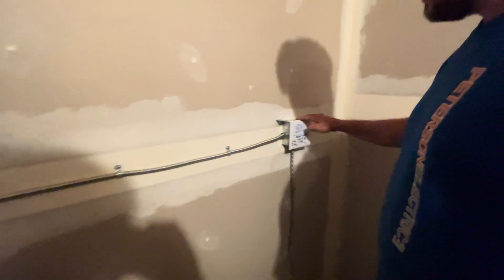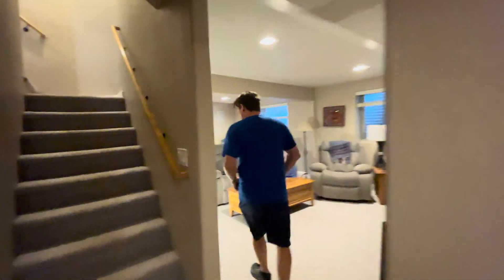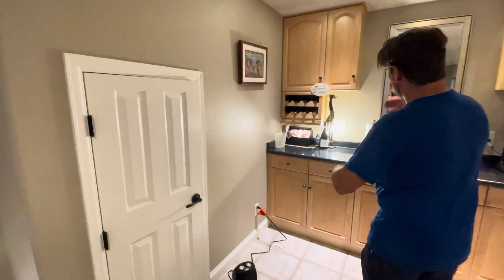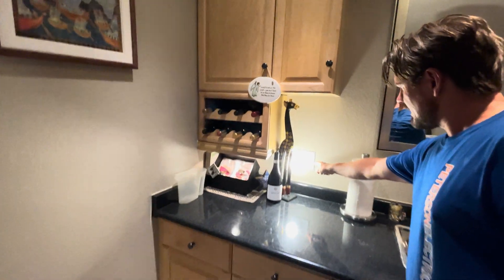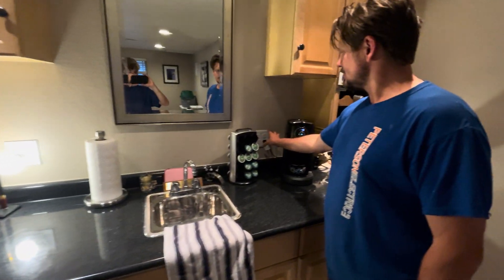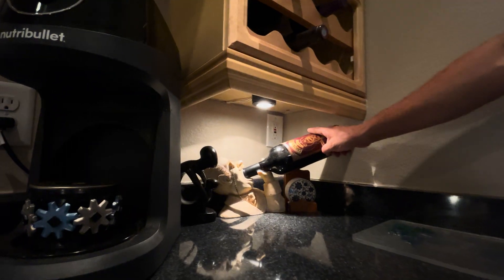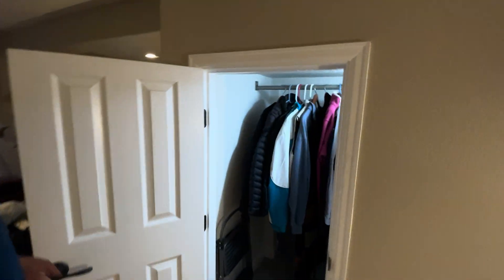Did another 12-2-2 right here and did a plug here, came in through here and went into this area. So all of it — there was no damage. Everything was surface mounted inside of here. It was very, very fortunate. Put a six-foot baseboard heater here with the unistat and then another plug. So we got two dedicated plugs right here for her, then fished through this back wall. We had 10 inches of back wall to fish, brought in the MC cable into this and then an NM cable over to here. So this is a dedicated circuit for these four, and a dedicated circuit for those four. They had this GFI right in here as part of all the outlets as well — they had like 20 outlets on one circuit. You can't do that. So now the kitchenette with the sink technically has two dedicated 20-amp circuits.